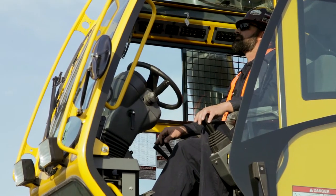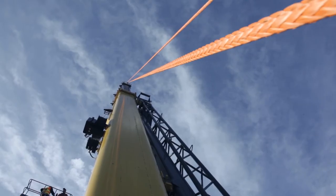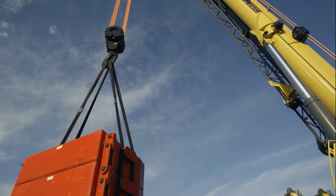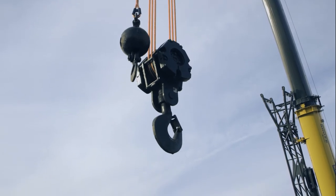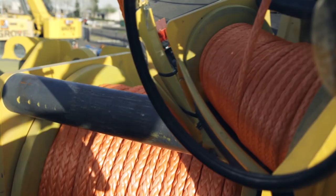Additionally, if synthetics are used with very low loads and then lifted with very high loads, you can create diving just like you can with wire. However, the diving does not impact the long-term life of the rope — it is recoverable. You can have that rope pulled back out of that dive, re-tension the rope, load it on properly, and then resume work.